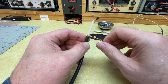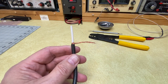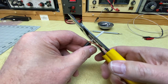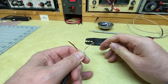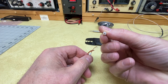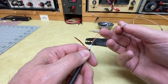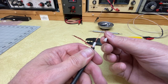This is the outer braid or shielded braid of a piece of coax. Next we're going to expose most but not all of the rest — we want to leave some of the center conductor dielectric in place. I heard a pretty good snap which tells me I may have overdone that. I pulled a whole bunch of wire out — see all that? Not good. Don't do that. Be very careful when stripping — only half the wires are left in here, which is not what we want. I'm going to redo this off camera.